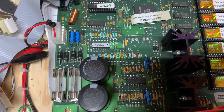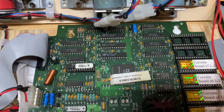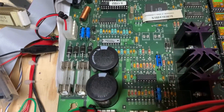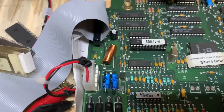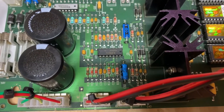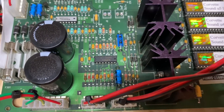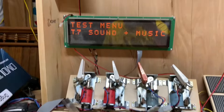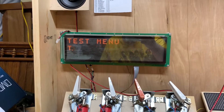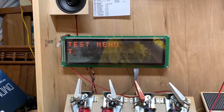I've replaced a bunch of one microfarad caps also. There's one 100 microfarad cap on here somewhere I replaced just for good measure — there it is. These were originally one microfarad 63 volt caps and they are directly in the sound path, and sometimes those can cause sound problems. That wasn't the problem with this board — the problem with this board was the torn through holes.